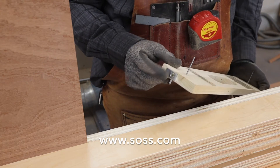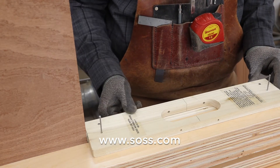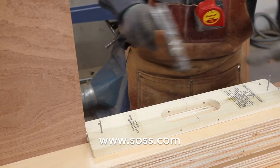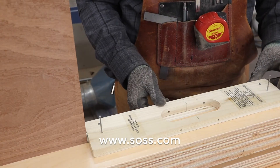We want to make sure we're referencing our locator pins to the face like we did with the door. We've flipped our tab up — this will act as a spacer for our door gap. Reference pins go here, and we butt the tab against the top of the jamb. We can drive our pins, cut the shallow mortise, and keep that setting and move to the other two hinges so we don't have to change the router settings too many times.